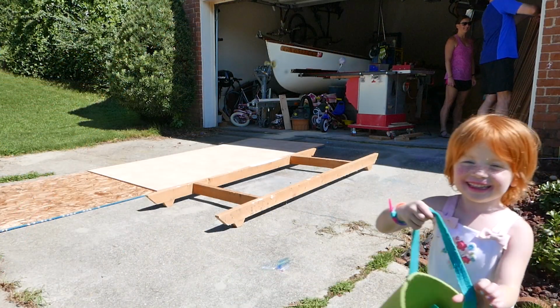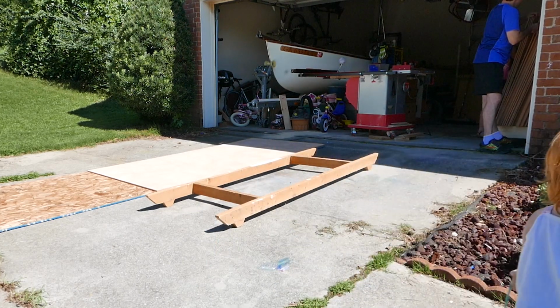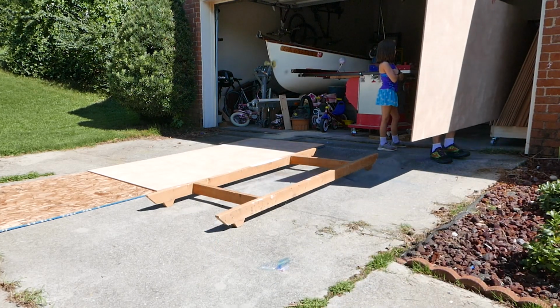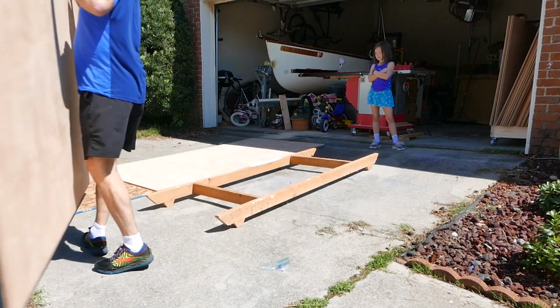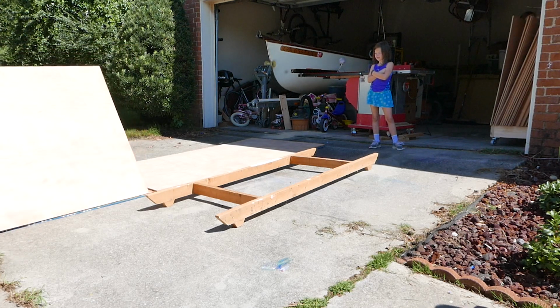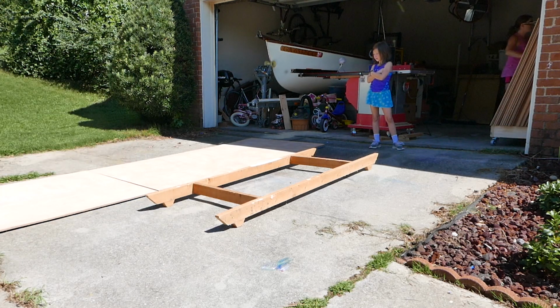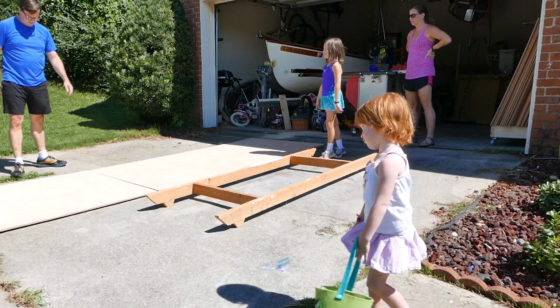Building a boat of this size presents some significant logistical challenges. As a stitch-and-glue design, nearly the entire structure is built from large plywood panels. This eliminates the framing used in more traditional designs, substantially reducing weight. The panels are BS 1088 marine grade plywood, a light, strong, rot-resistant plywood made with waterproof glues.